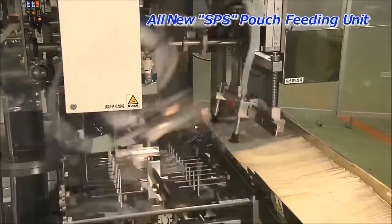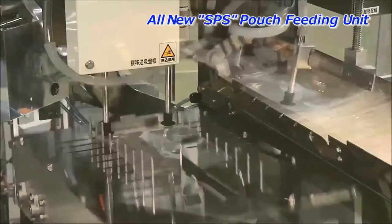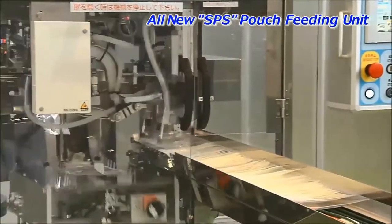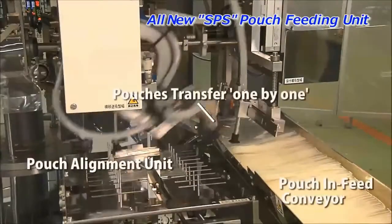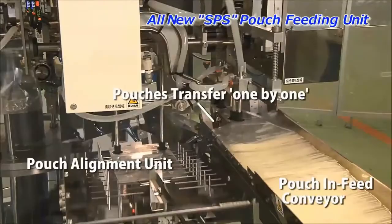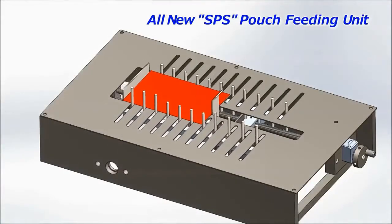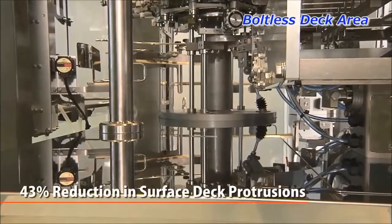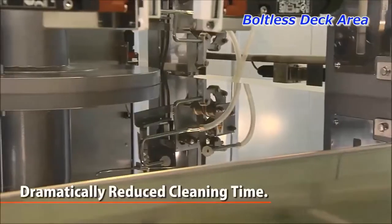The unique feature of the M3000 is the sidestep positioning system, in which individual bags or pouches are picked from the magazine, placed onto a mechanism that will square them in both directions, which allows for picking a single bag from a hard surface after it's been squared for presentation to the clips. This further facilitates the use of lighter structures, such as those materials that are becoming available for sustainability reasons.